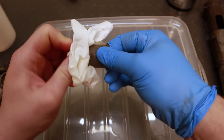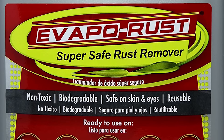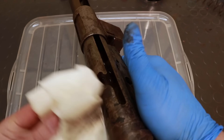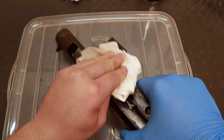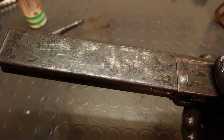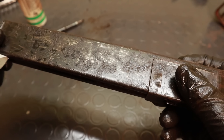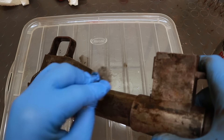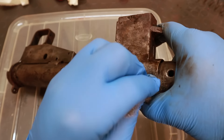For our uses, the simplest thing to get the job done is citric acid, since it readily dissolves iron oxide but is not strong enough to do any real damage to the metal surface. Nowadays there are even non-acidic agents that dissolve rust and oxide without damaging the substrate, and they actually work very well — a famous example is Evapo-Rust, but many other brands exist. After giving the solution time to react and a bit of brushing, we can wash it away, and what we're left with is mostly a bare metal surface with very high roughness in some areas due to corrosion. It's important to note that the metal oxidation here took place on a large surface, creating thousands of shallow pits — this is the least dangerous form of corrosion, and it normally takes years to corrode even a tenth of a millimetre.